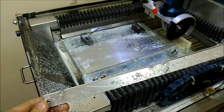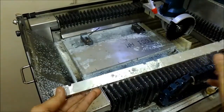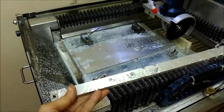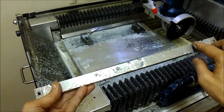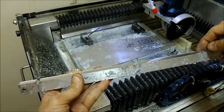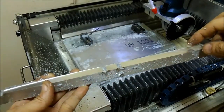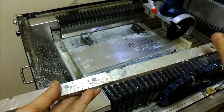It must be noted that we have to do full-length cuts — don't attempt to cut a shorter length than the full length of cut. Usually the jumping of the blade happens at the start or end of cuts. If it starts at some location shorter than the full length of cut, there is an arc of cut at the end. So when the cutting goes deeper, this arc length will increase much more and jumping will occur.